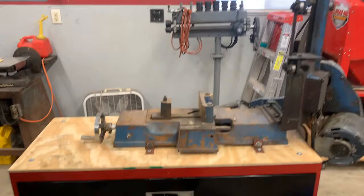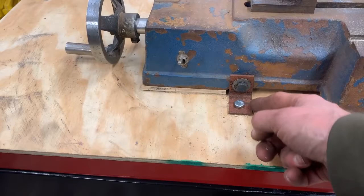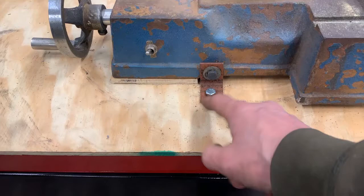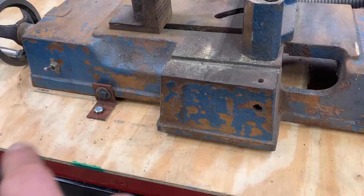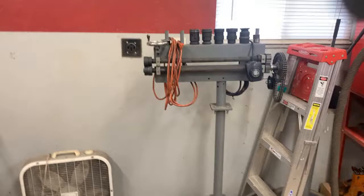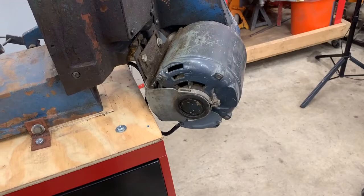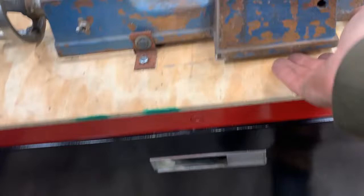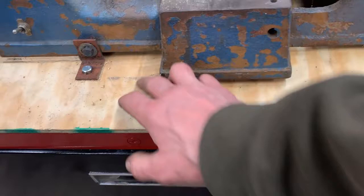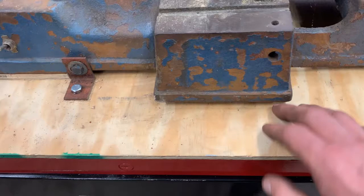There she is — all bolted up with some clearance. I basically used scrap plywood as spacers to raise it, then cut some angle iron into one-inch-wide pieces and bolted them on both the front and back, giving four attachment points. There's no weight in the cabinet yet and I can still take it vertical and lower it down so it's out of the way. I've also got clearance where I'm going to fab up a little chip tray to slide under there to catch the metal shavings.